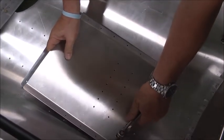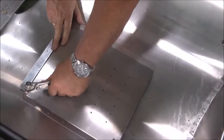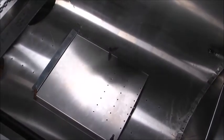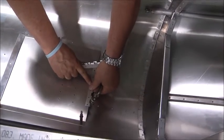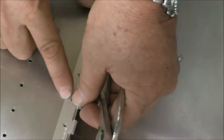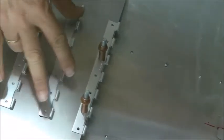This gets CLECOd in next, of course. We'll put a few CLECOs in here just to give you the idea. This will all get riveted. And then as I mentioned before, these seat adjustment strips - this one is outside of that stiffener, but the center six or so rivets all go through the hat channel. We'll continue that on with these here and go ahead and rivet that.